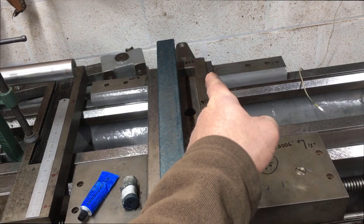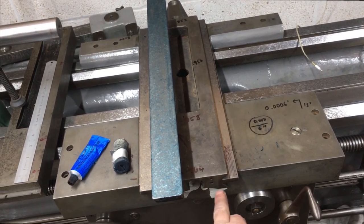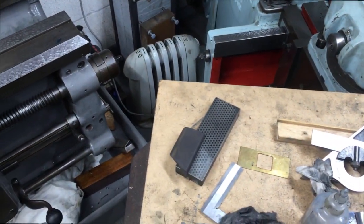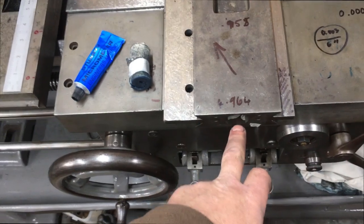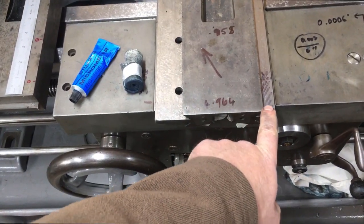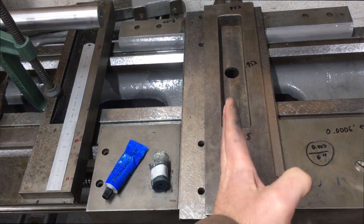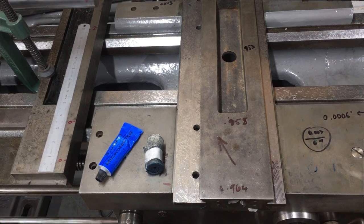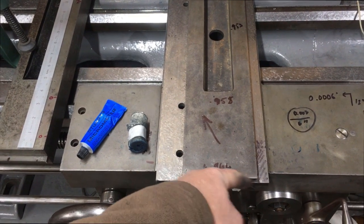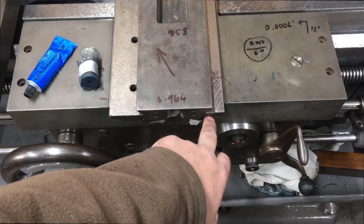So in order to send it from there to there, I've got to take material out that end, or material off the sliding part on this end. One of the considerations, let's move my straight edge, is because the cross slide runs through here, the screw and the nut running up and down there. If I start hacking away at this slide to get that alignment, it's going to throw the feed screw out of alignment, which on a worn screw and nut isn't a problem, but I've actually got halfway through making a replacement screw, so I want to try and keep that position good. So yeah, enough of waffling on. Get that humped out and start looking at doing this face.